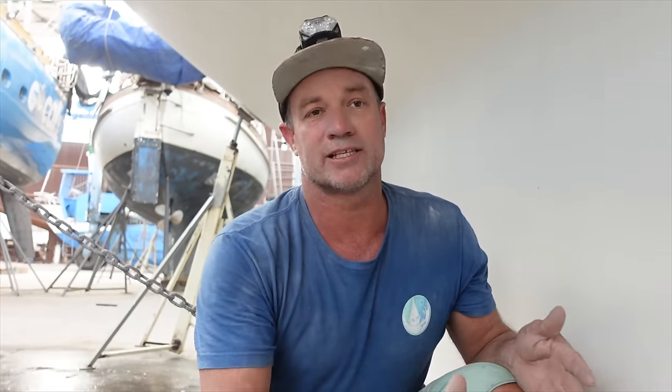It is a little tight. I don't know if it's growth or whether the cable's stuck up there. When we go back into the water, there'll be a day where we go back in the sling, we'll raise the boat and I'll slide the daggerboard out. I can remove the pin that I loosened up, pull it out, lift the boat and leave the centerboard on the ground. We'll re-antifoul the centerboard, clean up the cavity, inspect the cable and the outlet and see why it's tight — whether it's growth, cable or something. Now we're going to move on to other jobs and get back to the generator.